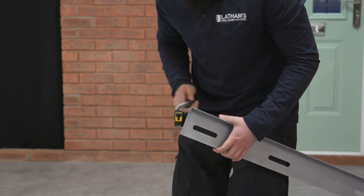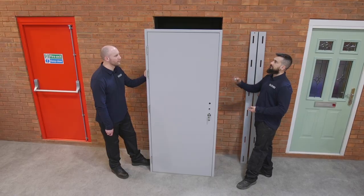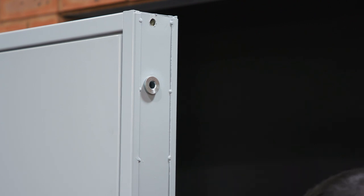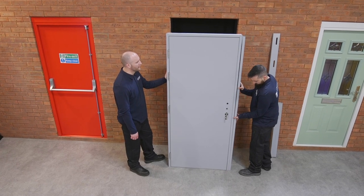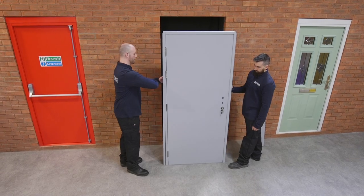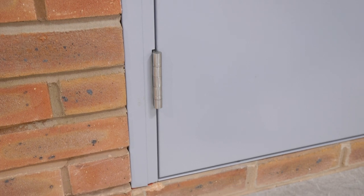At this stage, you can add insulation into the panel to enhance the thermal and acoustic performance. Attach the wind-out lugs to the door frame ready for the side panels to fit over. Slide the side panels onto the sides of the door frame and firmly push them onto the frame so they fully clip in. The side panels are now an extension of the frame and you should ensure they sit flush to the bottom of the frame.